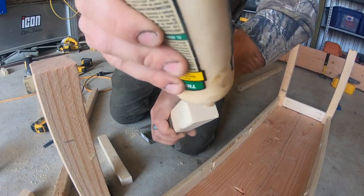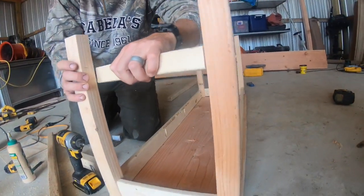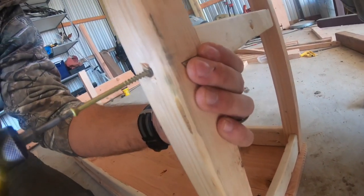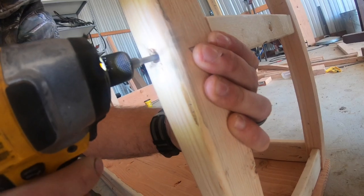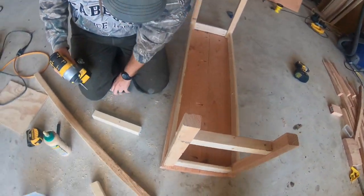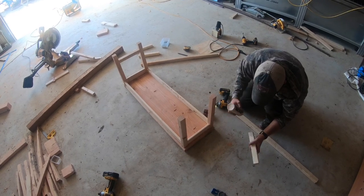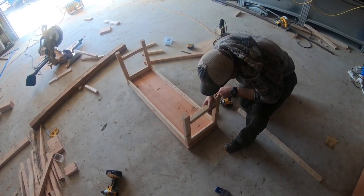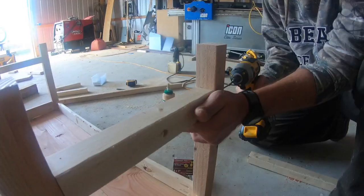Now that we have the correct size 2x2s, let's go ahead and attach those to that 3-inch mark there using my screw and dowel method. If you haven't seen my video on how to do this method, I'll put a link in the description for you. It's a super easy way to be able to use really long screws and be able to hide them. And it looks really cool when you're done. Oh yeah, by the way, make sure that hole on those 10-inch 2x2s is facing out. You'll see why in just a second.